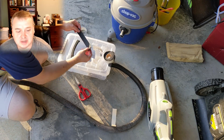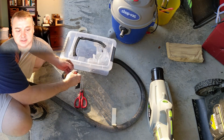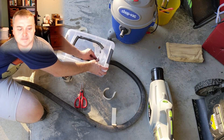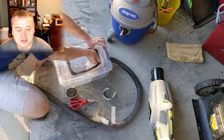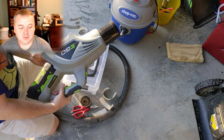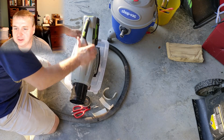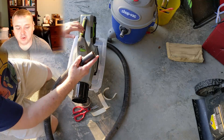This is weather stripping I just had laying around, so it seemed good enough for a quick concept test. We do still have a lot of vacuum loss due to some leaks around the hose and imperfections in my intake cutout where the plastic kind of split on me. I used some clear tape to fill up a few cracks. There was also a little seal leakage around the 1-inch PVC. I didn't try to silicone anything up or make it perfect — I just wanted a test to see if it's worth trying.